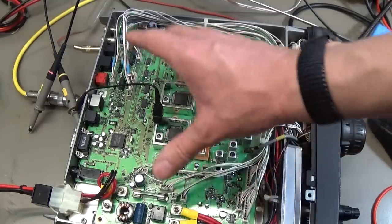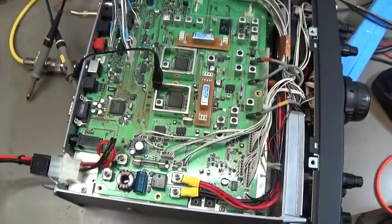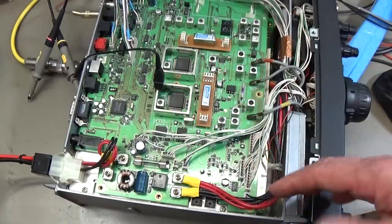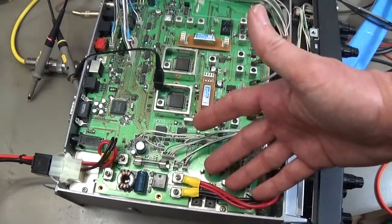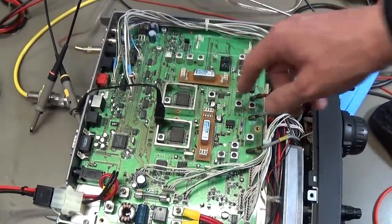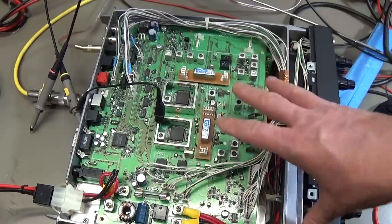Yeah, as I told you, that is not all I have tested, so there are some more steps I have tested and made sure that it is working. So for instance, here our voltage regulators, which we have down here, do not collapse when you load them. That is important as well, because sometimes you have voltage regulators which collapse simply when you put a load on them, or broken audio amplifiers. That is also very nasty. But in this case, it really looks like everything is fine.